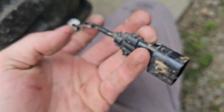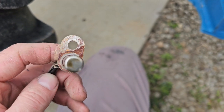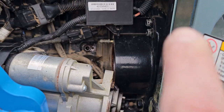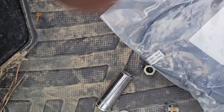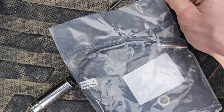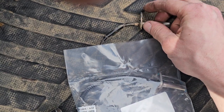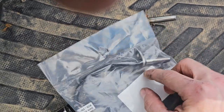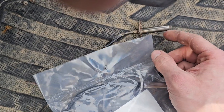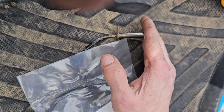Now obviously we've got our connector undone, and I believe you would think there's supposed to be an O-ring on this, so we're going to double-check and make sure we don't have an O-ring sitting right down in there. But there's our old sensor and there's our new sensor. This is what I was curious about — the redesign on it. We weren't having this problem all the time; it progressively got worse. But if you'll see how thin this tab is, and then look how thick this tab is...